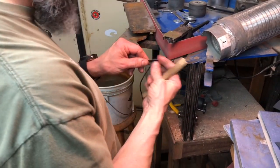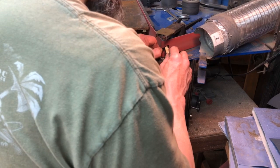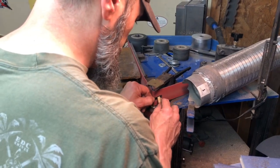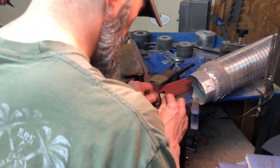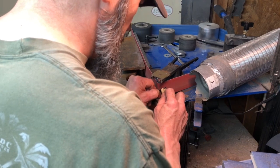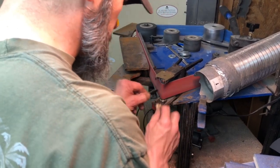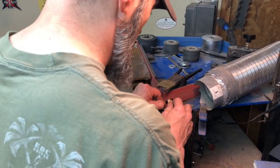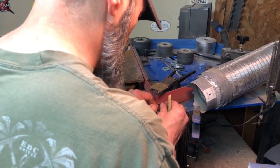This doesn't have to actually be perfectly flat. As a matter of fact, I kind of want it to have a little bit of a taper to it. So just using the slack belt like that, kind of like a flat platen, works out really good. It gets it pretty smooth and there would be no way for me to hold that on the actual flat platen the way I would need to. Anytime I'm working with something on the horizontal grinder on one of the smaller wheels and I get to the point where I need a flat or fairly flat surface, that's what I'll do — obviously not if it needs to be actually perfectly flat, but when you're just shaping and contouring and sculpting it, it usually works pretty well.